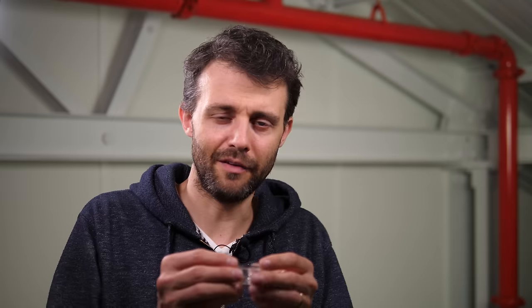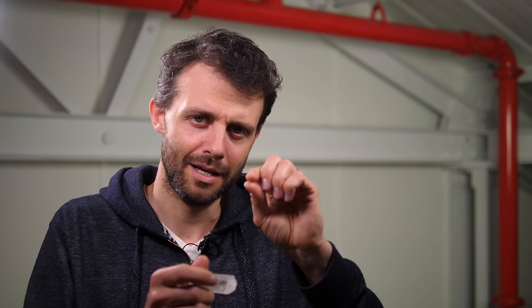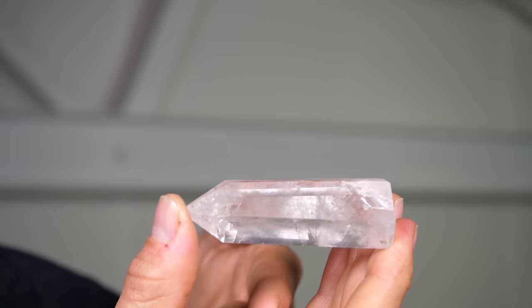This is what a giant quartz crystal looks like. If you were to take a slice of quartz away from this crystal and compress it, you'd be able to measure a voltage across the slice. But you'd have to slice it at just the right angle — something like that, and it's got to be just right. And to see why you've got to get the angle just right, we need to look at the lattice structure of quartz.